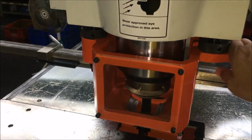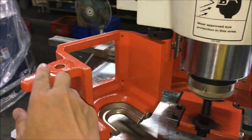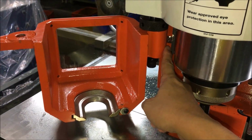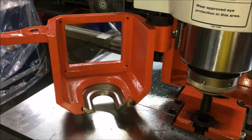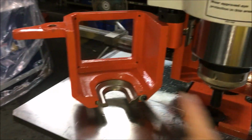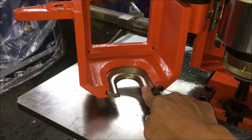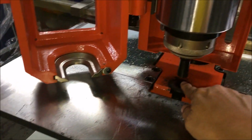The stripper, which protects the operator, has an interlock limit switch. So under the normal mode, with the stripper open, the machine will not move. It has an exchangeable plate which should match the size of punch.